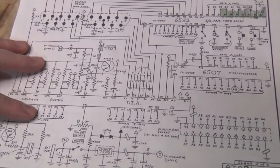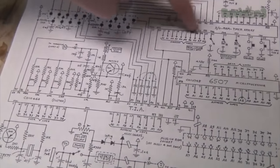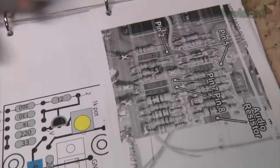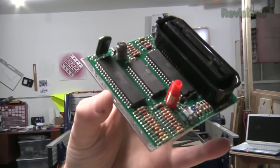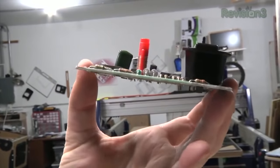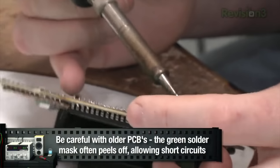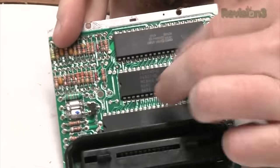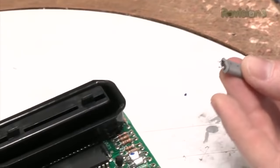Here's a schematic of the Atari that I downloaded off Atari Age. You've got the three main circuits: the timer, RAM, processor, and the video. And I have some diagrams here which tell me how to remove the resistors and mod it into a composite video output. Take a look at it from the side — most of the components are pretty flat, and we don't need this thing, so you could actually flatten this out and make it fairly thin. You know what's weird about some of these old circuit boards is when you desolder them, it smells exactly like Tang beverage drink. I really don't know why — maybe it's because the astronauts had Tang and there was a space shuttle back then.